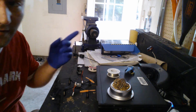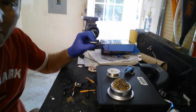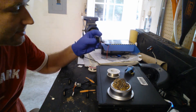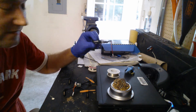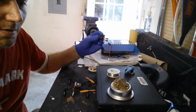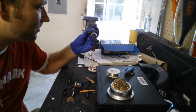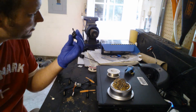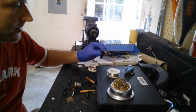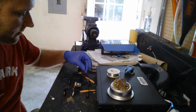If you own Fat Shark, you have to own Fat Shark. First thing you're going to need is the TX5805 from Walkera. I've already checked it out and completely tested it. It works with the Fat Shark goggles, but you have to set it up on channel 8. It has to be set up on channel 8 and it will work — works quite well actually. The range isn't going to be real long.